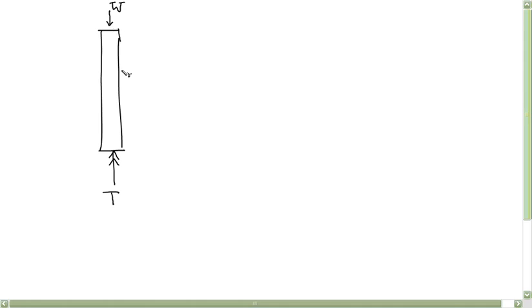And that weight W is supported by, now I'm going to take advantage of the fact that the surface area doesn't matter in these friction calculations, okay? Because you know there's a long surface area of thread that's touching this tapped portion of whatever it's traveling in, right? But let's just assume, since that surface area doesn't matter, that what's really touching is just a single block like this, okay? Just that one single little place is traveling up this path.